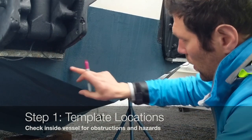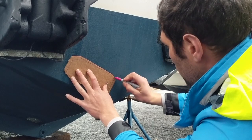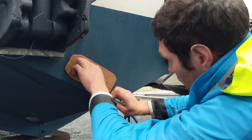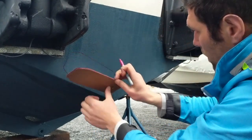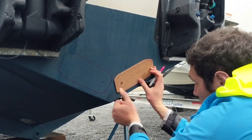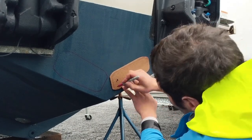The first thing you want to do is figure out where you want to mount your lights. We made simple templates out of cardboard — there's a hole on one end that mates with where the wire comes out of the back of the light. The templates are about three-eighths of an inch oversize from the true size of the light. You can make these up easily with a piece of cardboard before you get to the boat.